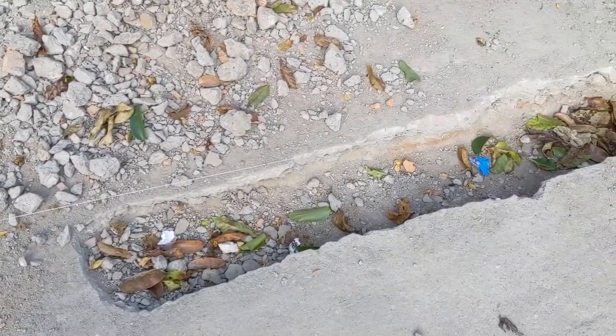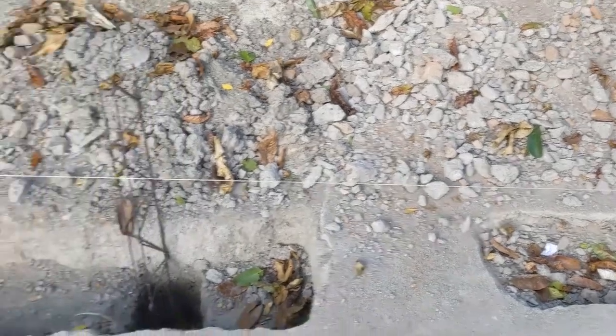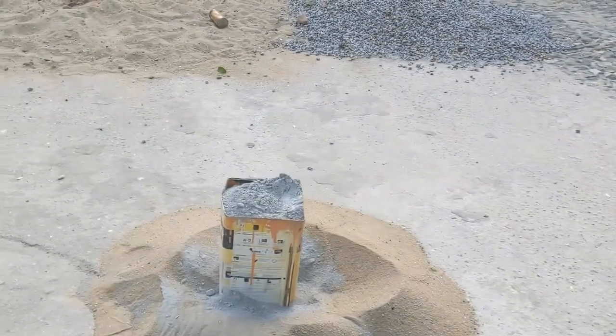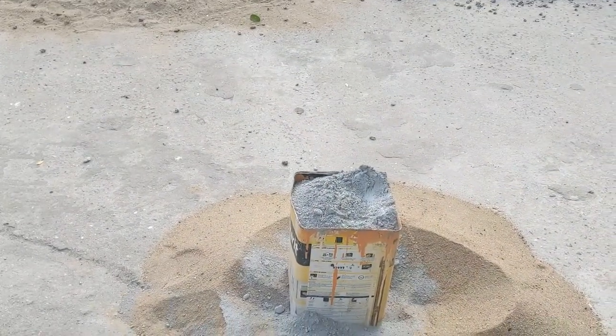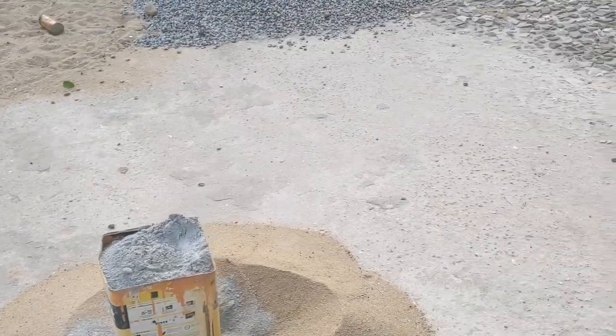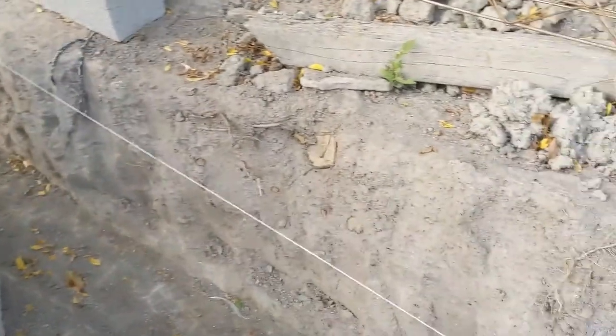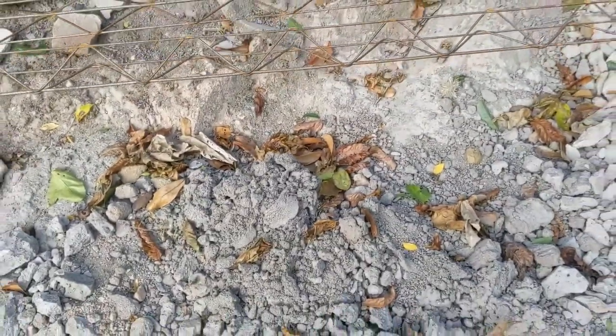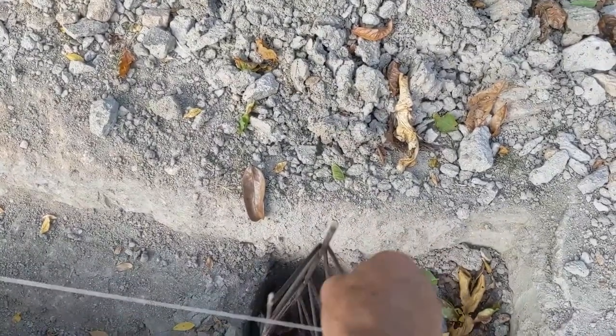I have my place dug up. The other day was very windy with a lot of leaves, so I'm just gonna clean it up and start to set up my blocks and my cement. I'm gonna mix it like a three sand, one cement ratio. I dug some holes and there are quite a bit of leaves in there. For the block orientation, you put it this way because this part is the thicker part — it holds more of the weight. The weight is gonna come from that side, so this is the way it goes.